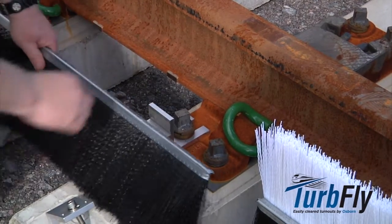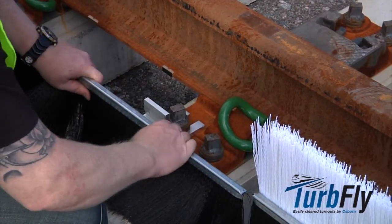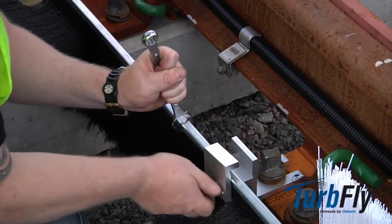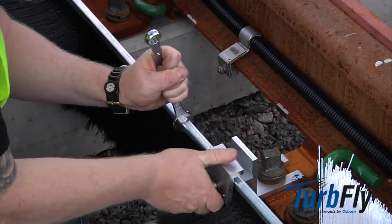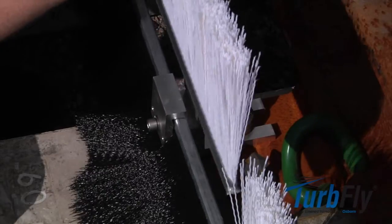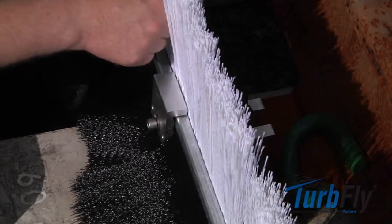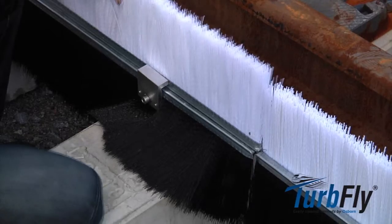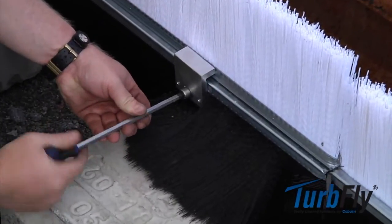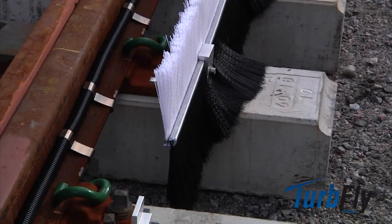Place the lower black brush into the fork piece. Assemble the L-shaped holder on the guide pins. Mount the washer and the screw and turn the screw a couple of turns. Push down on the upper white brush section behind the lower black one and tighten the screws. The first section is mounted — just continue the same way.